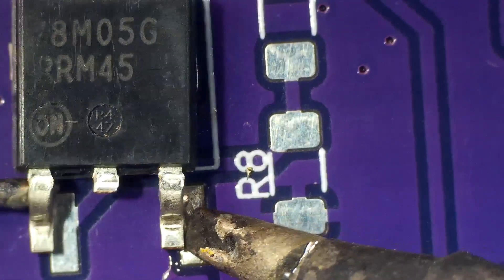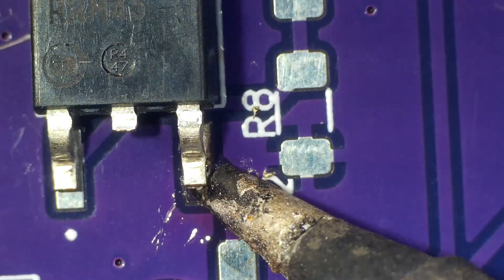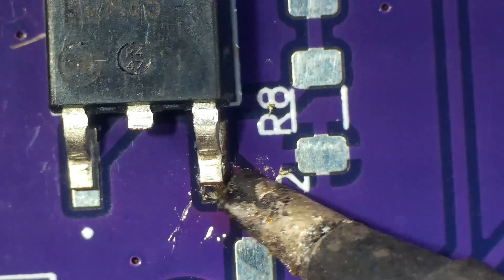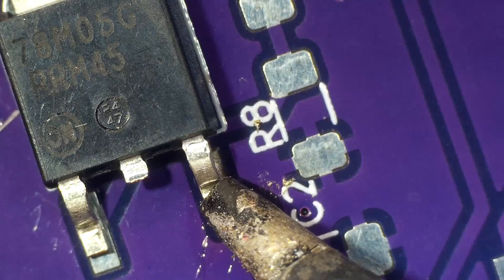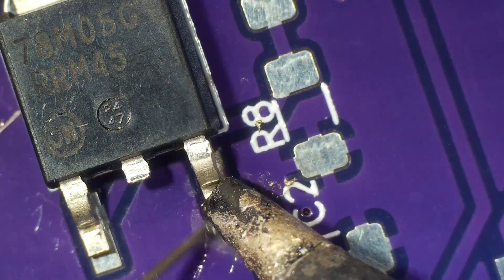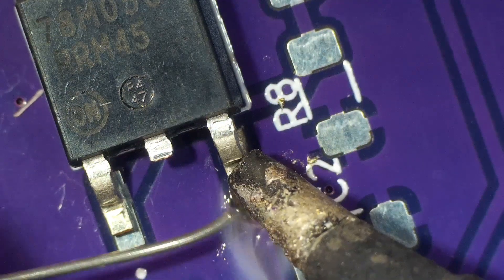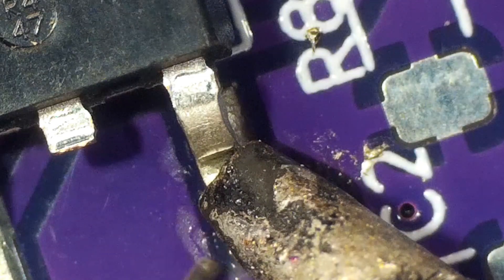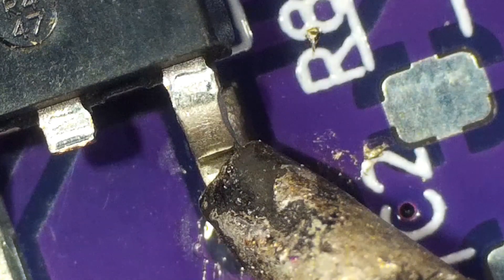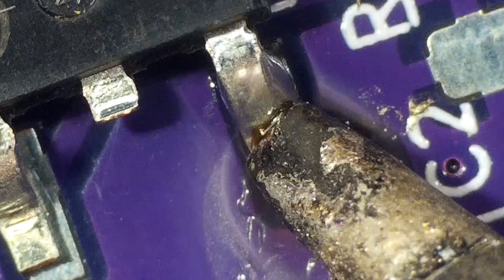It's basically a dirty tip. I'm going to put the tip on top of the leg and the whole thing gets soldered, but I end up putting way too much solder on there. You can remove the solder if you want — I'll show that a little later. You can see I'm adding solder underneath a little bit, and there it goes — the solder just flowing up the leg, up it goes. That's because solder will flow uphill; it wants to join itself to hot metal and dissipate over a large surface area.